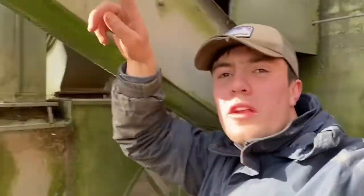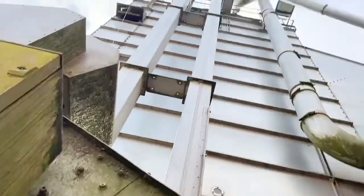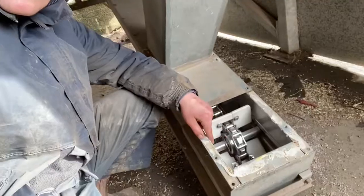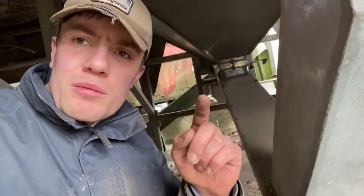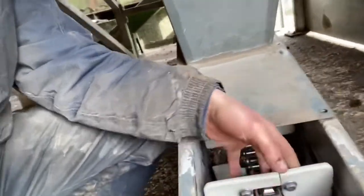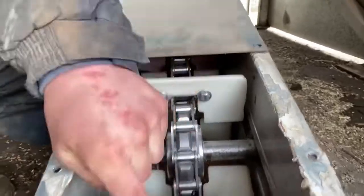You'll be able to see the elevator buckets. They come down on the big belt, scoop whatever crop's at the bottom, and carry it up to the very top of that elevator, where there's a valve which switches position — either sending it off into the shed or sending it back into the dryer hopper. This is the bottom elevator; grain travels up that spout and lands in the bottom of the elevator I just showed you. There's a big belt with paddles on it and they just draw the grain up the hill.